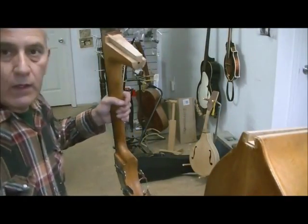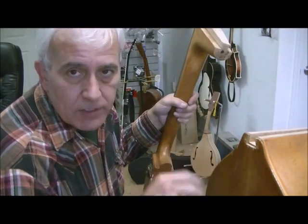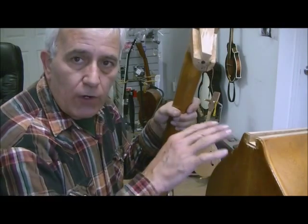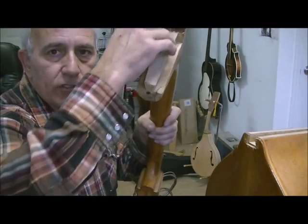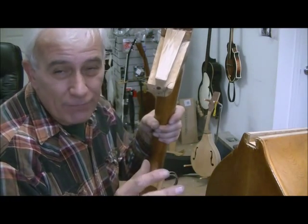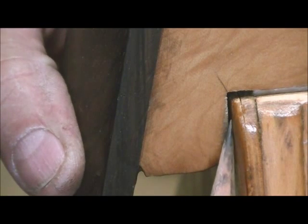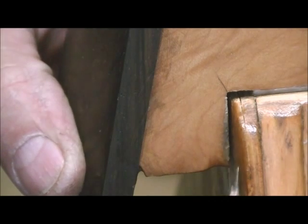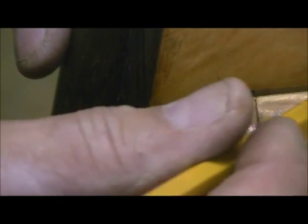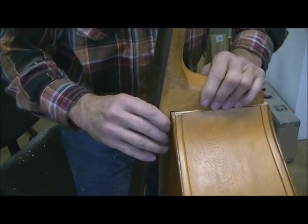There's a good chance I'm done. Last time I stuck it in there it still had pencil lead all over it so I could see the marks, and I carved away those last high spots and then scraped all the pencil lead off — which actually makes it a tiny bit smaller too. I'm hoping it'll fit all the way; it might still be a hair tight but it should be very close. There's about a sixteenth of an inch from going tight. This joint is just incredibly tight — when I wiggle it, there is absolutely no play whatsoever.